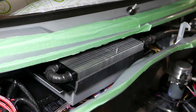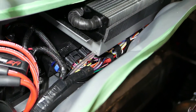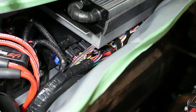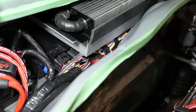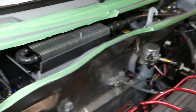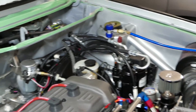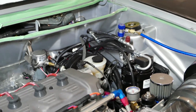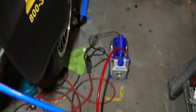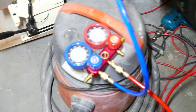The air conditioning system is fully installed. I got a little drain tube off the manifold to keep water from dripping onto the connectors for the Holley ECU — they're waterproof, but still. She's installed, all the hoses are in, and I'm currently running a vacuum purge and leak test. It's holding tight, so there's my little vacuum generator.